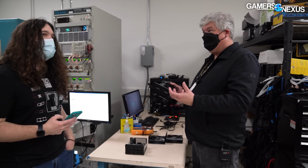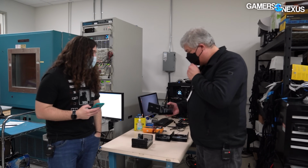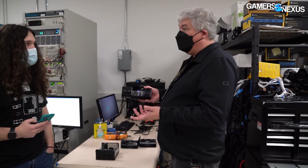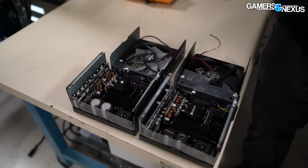And on the motherboard example, a lot of the time the VRM, the capacitors closest to the socket, they'll typically be left out of the heat sink. Yeah, exactly. Like your MOSFETs on the DC to DC. There's no heat sink on them. Capacitors get hot. Capacitors need cooling. There you got a little tiny cap down there. Needs airflow.